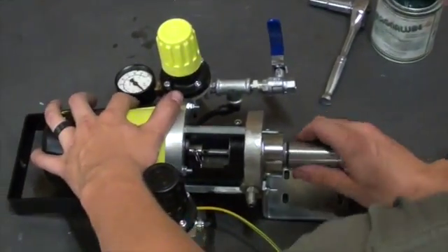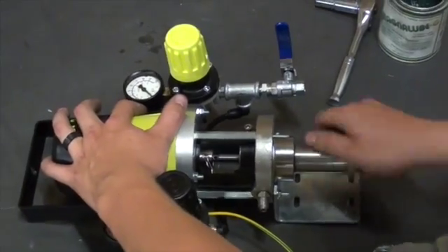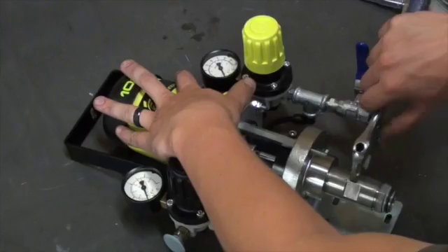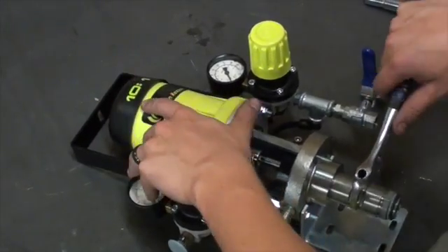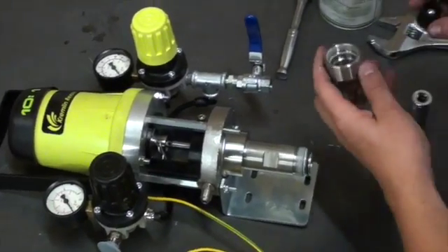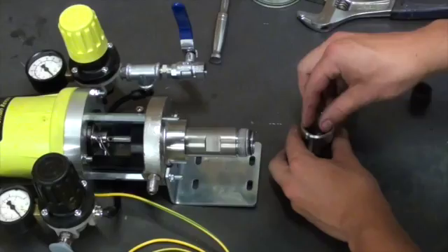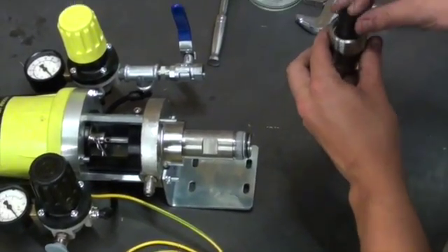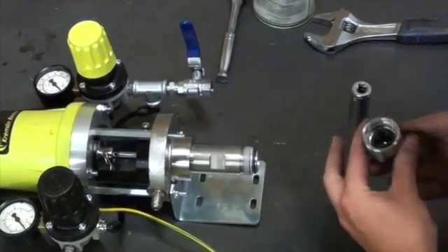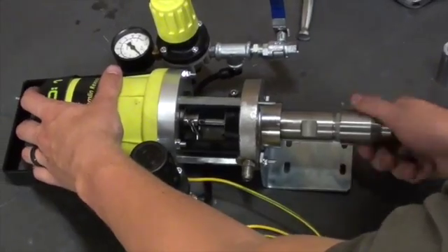Following the installation of the exhaust valve assembly, we will grease the two seals on the cylinder and then we will be able to screw the cylinder back into the outlet flange of the pump and tighten it with an adjustable wrench. Once the cylinder is tightened down, we will put the lower ball assembly together by first putting the ball in the pump foot, which in turn is followed by the ball cage. Lastly, we will need to screw the suction valve assembly back into the cylinder.